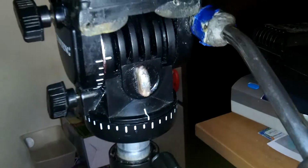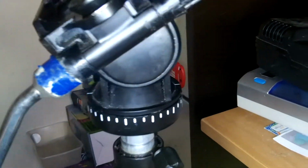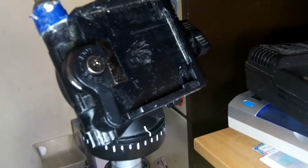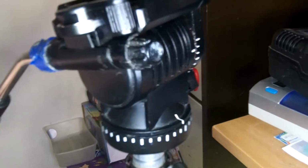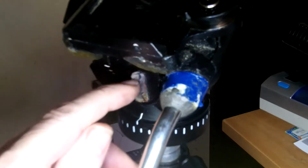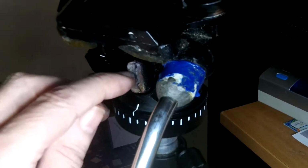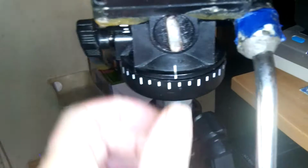Oops, my tripod is actually more jerky than the fluid head. Just a budget fluid head. So if you're looking for budget fluid heads, don't expect miracles out of these. Friction is adjustable to a certain extent by turning this knob, which I've added to because it was very hard to turn. Still hard to turn, but a lot easier like this with some super glue and baking powder and such like, and paper to make the knob a bit bigger to turn.